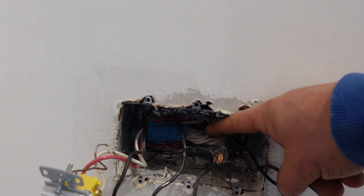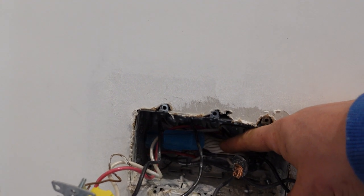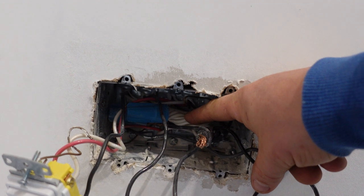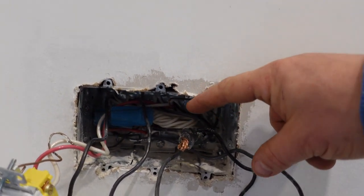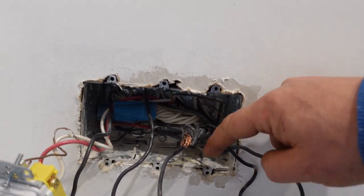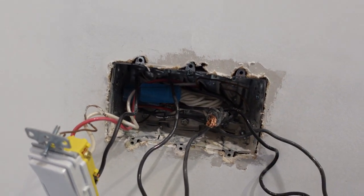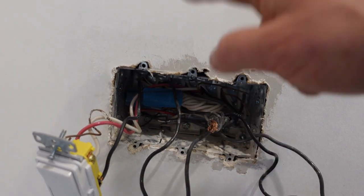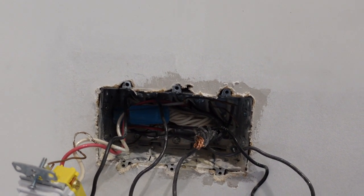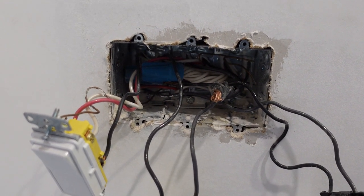In particular, when you're doing lights like this, we have one feed coming in. You can see all our blacks together and all our whites together — the white neutrals go to the associated lights and the power feeds out. This is the main power feed coming from the electrical panel, and it's live. Off of this, a pigtail goes to each switch, and then from the load side it goes up to each set of lights. That's how you connect wires in the back of a box when you have multiple lights on one power source.